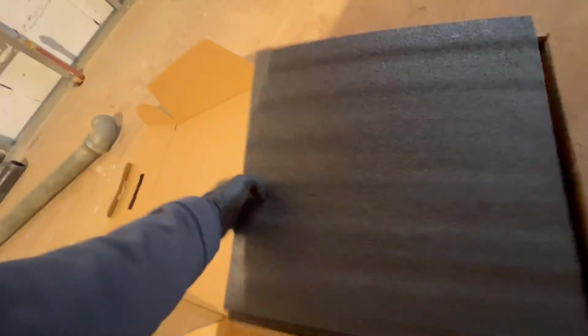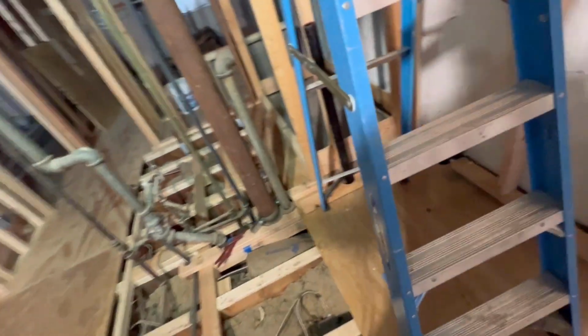Guys, when you're roughing in a bathroom, a kitchen, whatever it is, do the waste first. Do the waters next, because the waters you can work around anything. All the waste and the venting has to be pitched properly. So right now we are putting our 4-inch riser clamp in. We're going to get our snap cutter. I'm going to show you how to snap this stack.